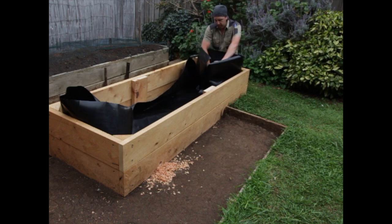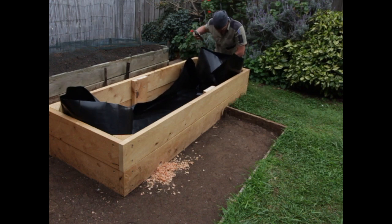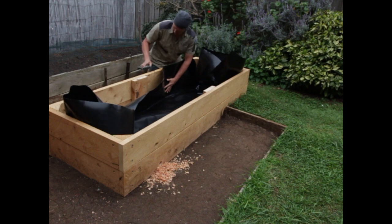One of the best ways of doing that is when you're in the side of here, just grab the liner and just push it down, get the feel, make sure it's down into the corners down there like that, and then stapling nice and high so you're nowhere near the bottom of the reservoir, nice and high on the bed. We're in, we're away, beautiful. Let's do another one around here.